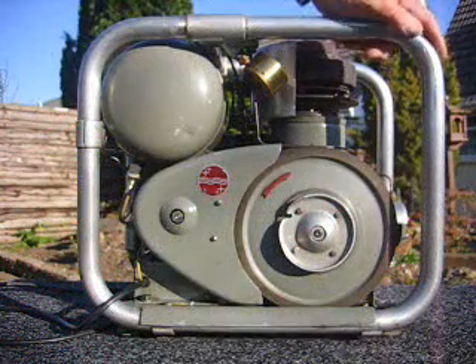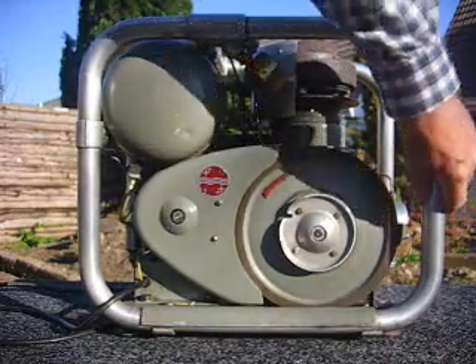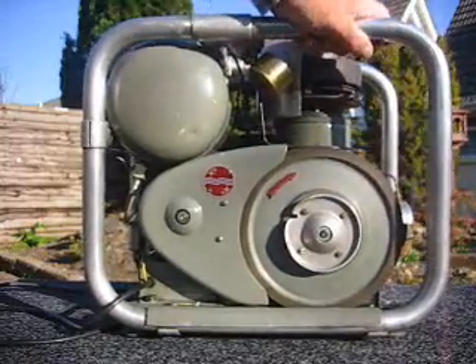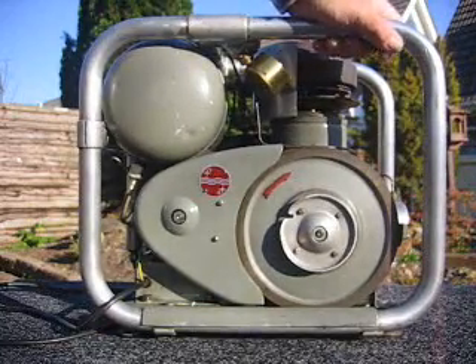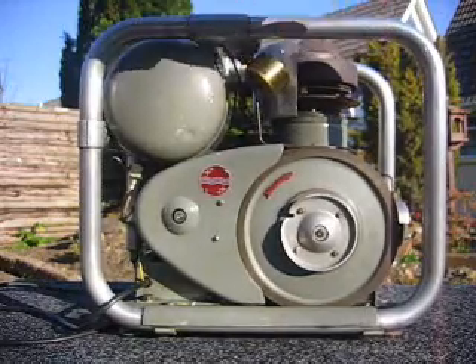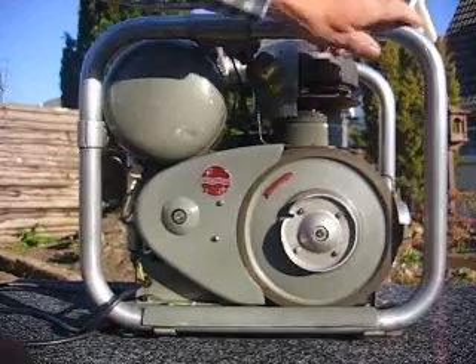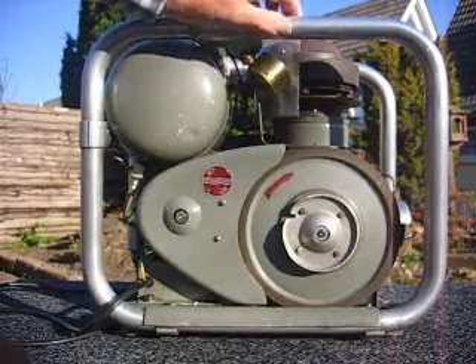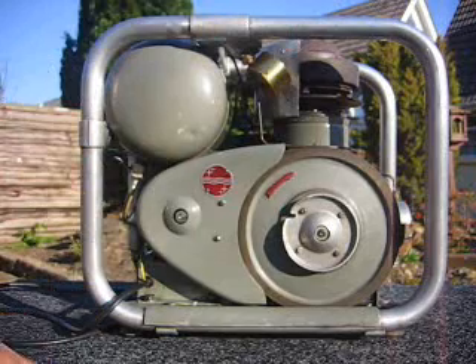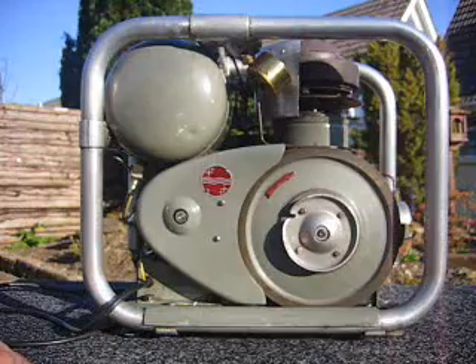These carrying handles serve two purposes. They're obviously for transporting and holding the thing together, but also they store the air which the compressor produces, so that you can start the engine next time. One of the big failings of these engines is that they don't hold quite enough air — usually the air is exhausted before the engine is hot enough to run. So I use an auxiliary means of adding a little more air to get the engine to run. The starting process is rather tedious and fiddly, and I think that's why they weren't a commercial success.